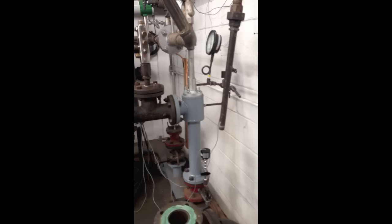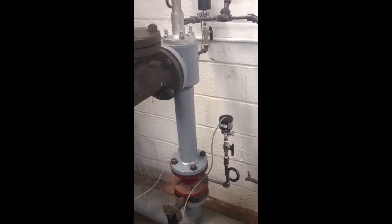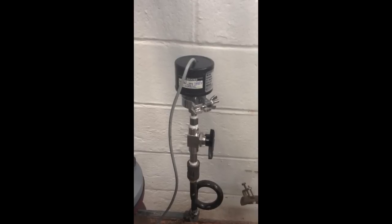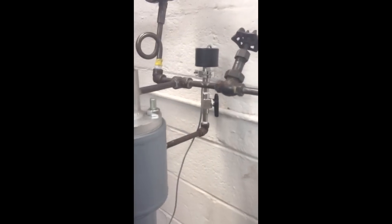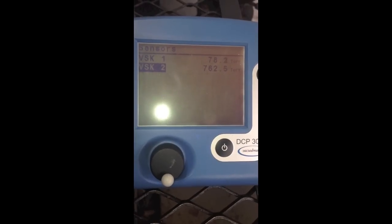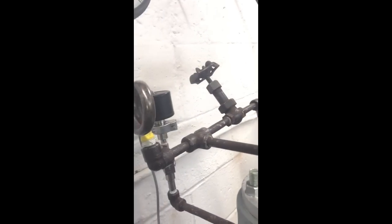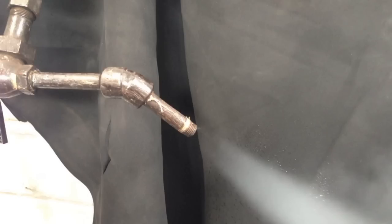Here we show the steam ejector set up to have a performance test done on it. We have set up a pressure transmitter on the discharge end of the ejector so that the back pressure on the ejector can be measured. Here we show the pressure transmitter on the suction head as we measure the vacuum. The transmitter is set up to show both the suction and discharge pressures measured in torr. Here we show the steam motive pressure gauge set at 90 PSIG. It has a steam siphon in it and we put in a tap for blowing down steam to keep the moisture out since we are not insulating the steam pipes for this performance test.